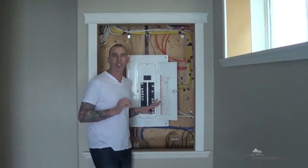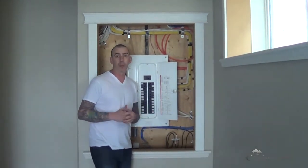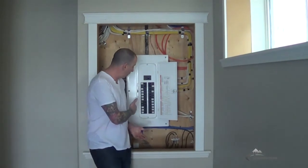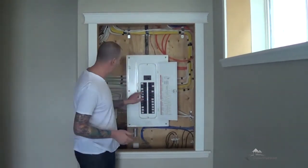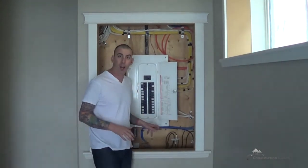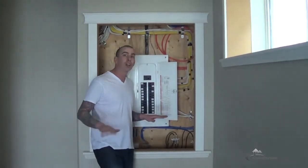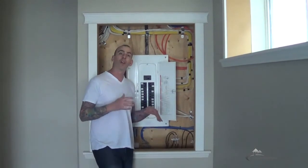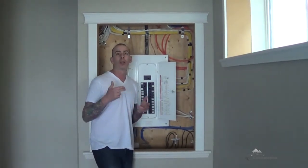The chart is way down low here and it's hard to really read or understand what each breaker does. So what I suggest doing, if you're unfamiliar with it — and just for the safety of the people around your house — because if the breaker goes off and you can't tell what breaker has gone off, they start flicking around in there and it can be quite dangerous. So I would suggest running some tape right down the sides of the breakers themselves and individually labeling what each of those breakers does throughout the house. So if this one breaker down here does the nook lighting and all the plugs in the nook, then you want to label that 'nook lighting and plugs.' Some electricians when they are labeling the panel are very broad with their explanation — they might just write 'nook,' but you're not aware if it's the nook lighting or the nook receptacle.